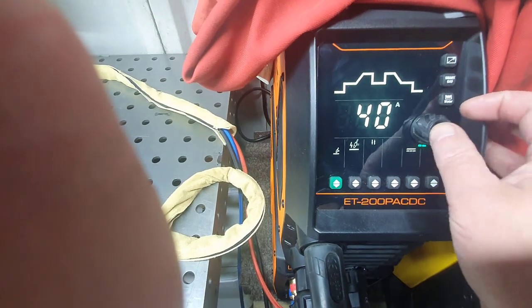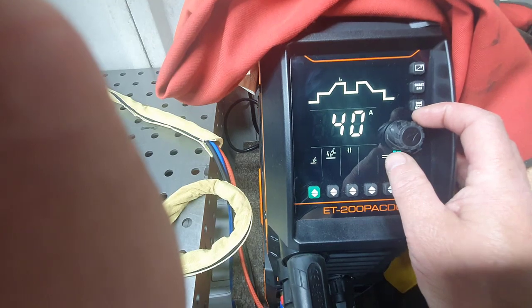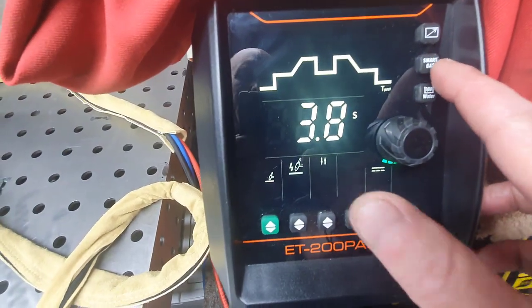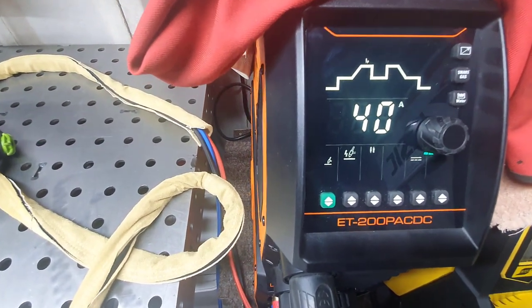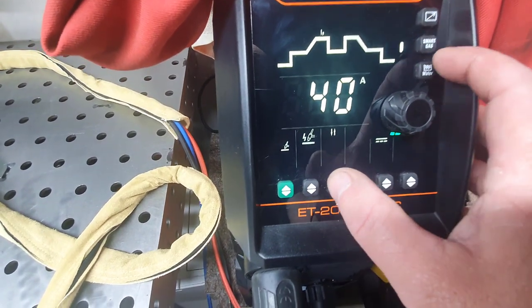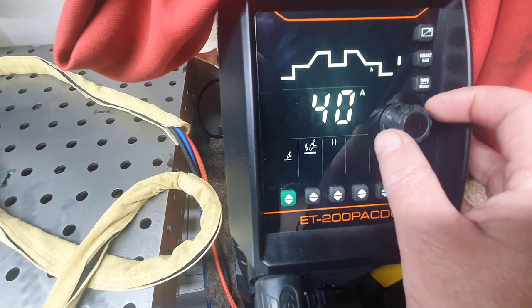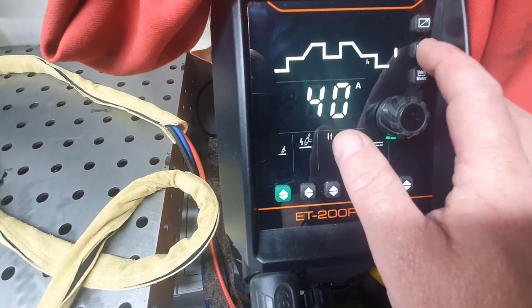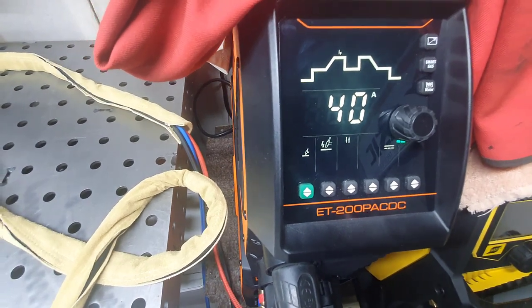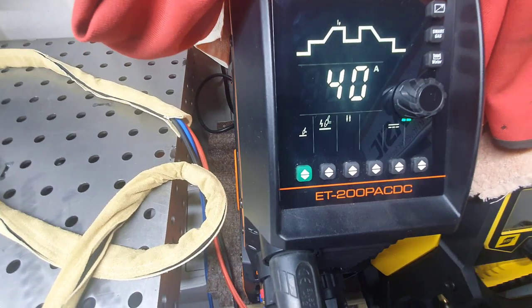You can come back and forwards now where the other one used to go round and beep. Your graph lights up and you've got little letters at the top - they could do with being a bit bigger if I'm honest. Going right from the beginning, you can see you've got pre-flow, starting amps, up-slope, main amp, slope down, finishing amp, and post. What this machine also does is smart gas - so based on your amps, if you hit smart gas, you don't get to set the post manually. The machine sets the post flow automatically depending on how many amps you've welded.